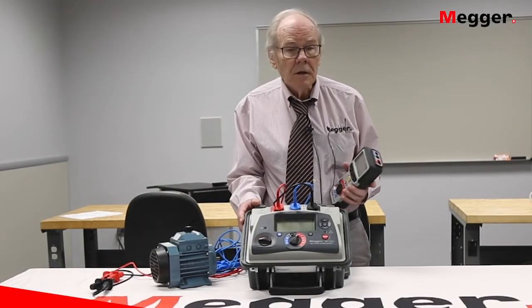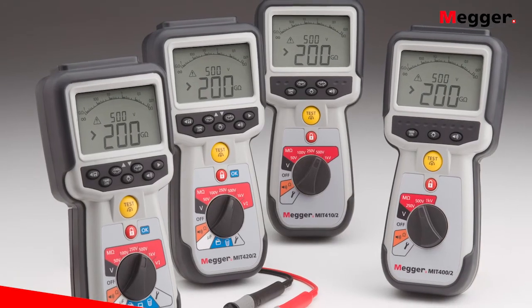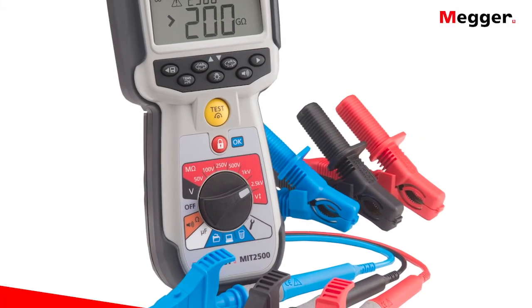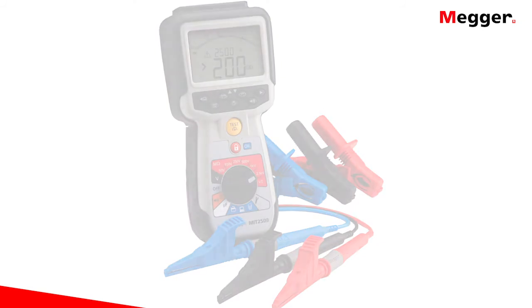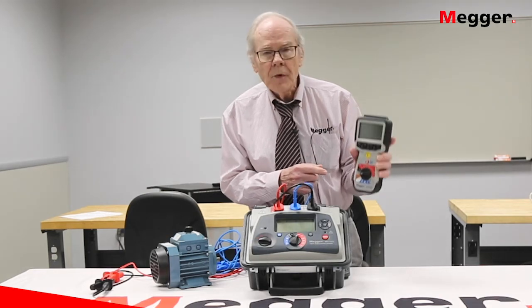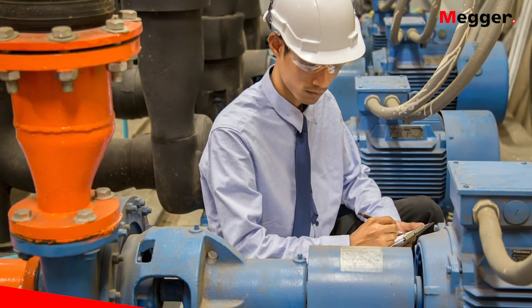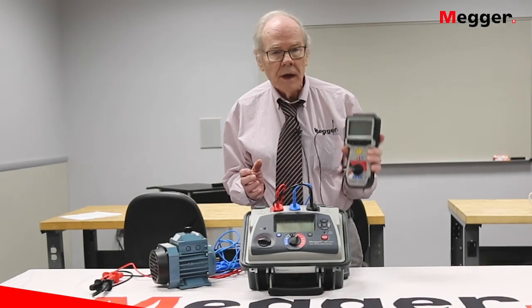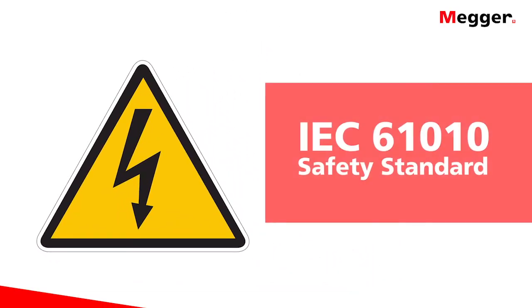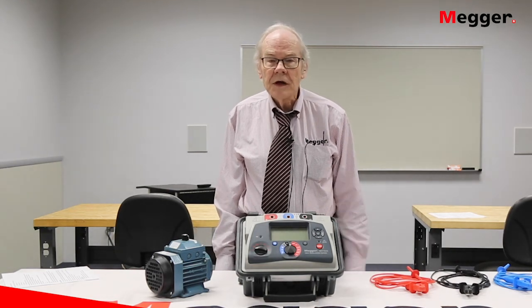We've been looking specifically at Megger's medium voltage testers, but Megger also produces a complete line of handheld 1 kV testers, plus the MIT 2500 which ranges up to 2500 volts in a convenient handheld unit. Why not make one in 5 kV? Because operator safety is paramount in all Megger products, and that much voltage in a handheld unit could not conform to the IEC 61010 safety standard for operator protection. Thank you for watching — Megger has a team of applications engineers ready for your call or email.